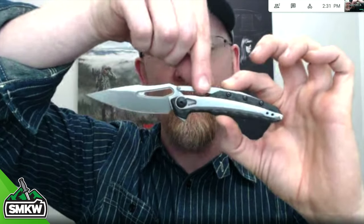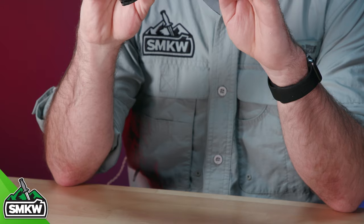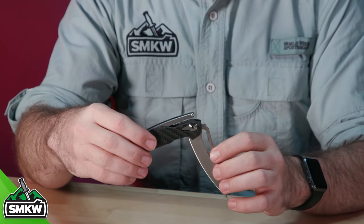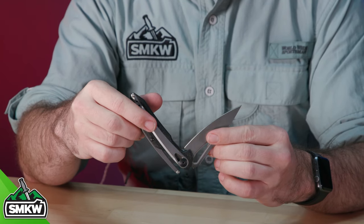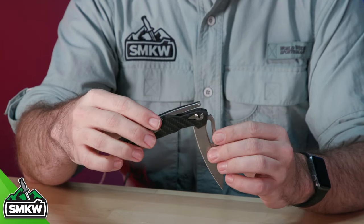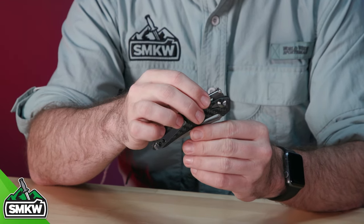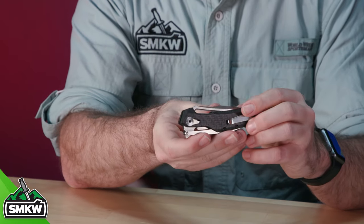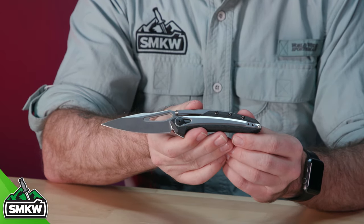We've tried to maintain the soul of that knife and some of the cool things that made it what it was. The key feature of that knife is what I call this floating bridge. When you open the blade a little bit, you can see that it's totally free-floating. That backspacer running right up to the stop pin is just its own separate piece. When you close it, your flipper rolls right through there and lands on the stop pin again. So it's got great action, nice snap.